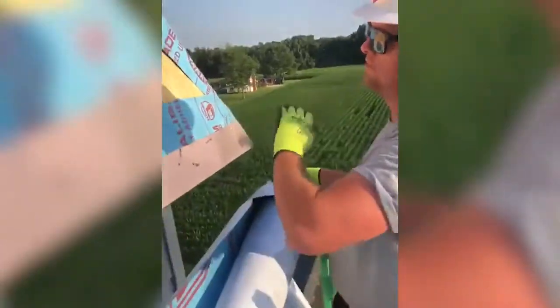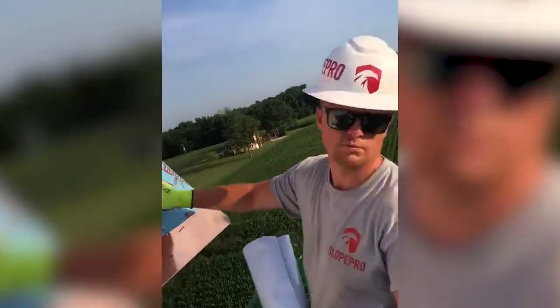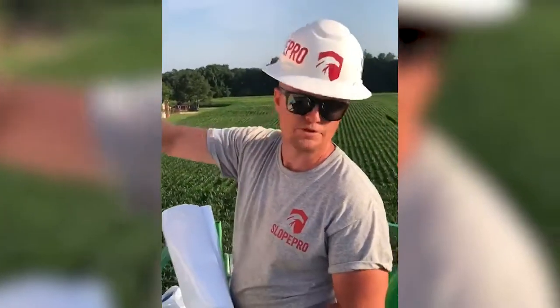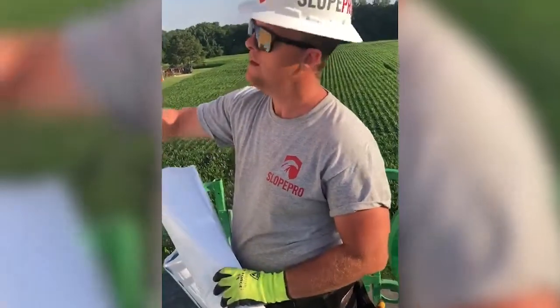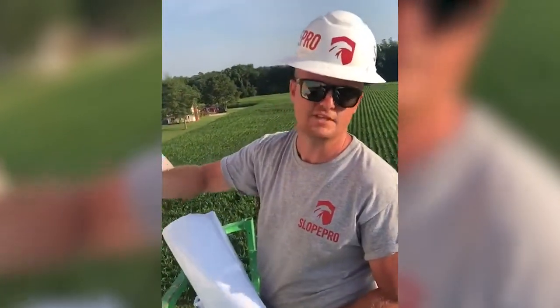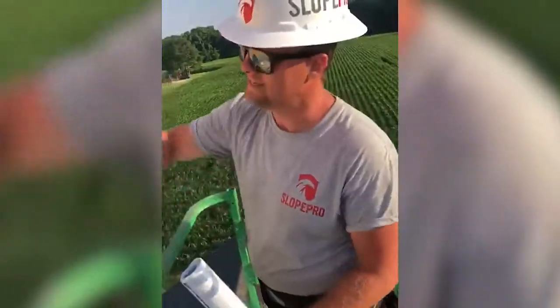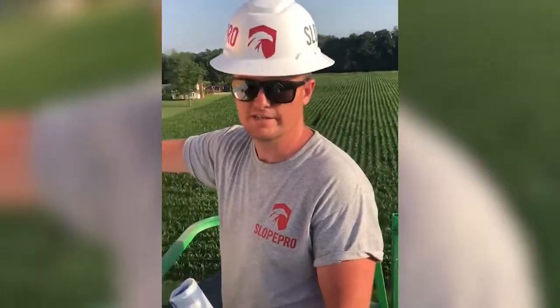It's this product right here. We're going to put this down over the deck — it has an adhesive back on it, so essentially when you roll it out, you can see it sticks down to the roof deck. After it's up here for a couple of days and the sun has heated it up, it's going to glue itself right down. So even as we're fastening these copper shingles to the roof, the shaft of the nail going through this product is actually sealing around that nail. As you get condensation on the backside of this copper from temperature exchange, it's never actually soaking into this roof deck. When you're doing a roof like this that's going to last 100 plus years, you definitely want to make sure you're doing the entire system to take that lifespan.